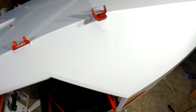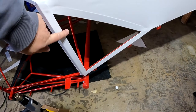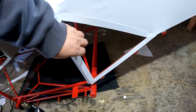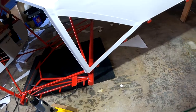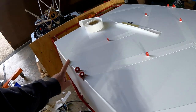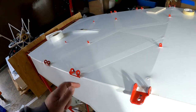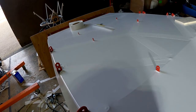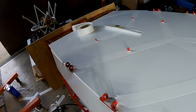I've had a few places where I wish I would have done things differently, but it's coming out fine. One last thing — for the windows I asked on the forum whether people just cut them off net or trimmed a little excess and wrapped around the corner. People have done it both ways, but the safest bet seems to be cutting about a quarter to three-eighths inch of excess and wrapping it around — so that's what I did and it came out all right. Come back in February — I'll get these edge tapes done, get my landing gear back on, order a T3 tailwheel, mount that up, get this thing right-side up. See you next month.